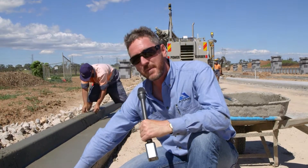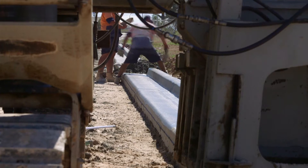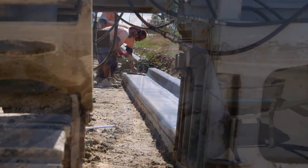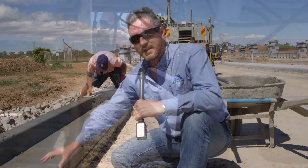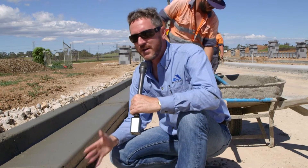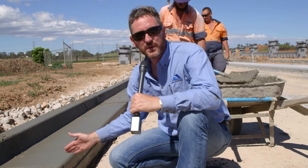Now this mix is a little bit bony, and we're seeing a couple of little holes, so what they'll do with this is they'll spray it with a little bit of water and then trowel it nice and close so it'll be nice and smooth. The good thing about this kind of concrete is that it's strong and sturdy and will go hard quite quickly. You'll be able to backfill it the next day, or run your grader blade along it without scoring it.